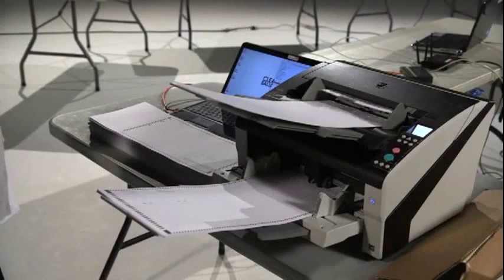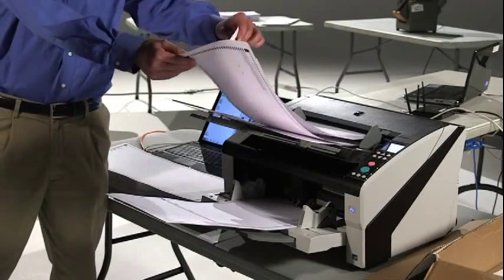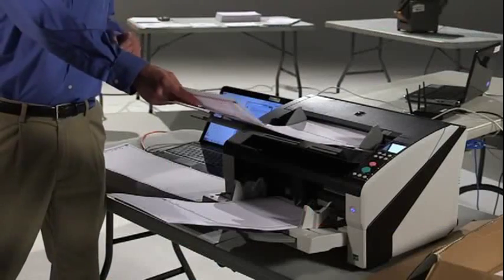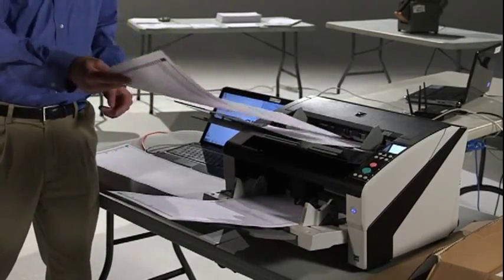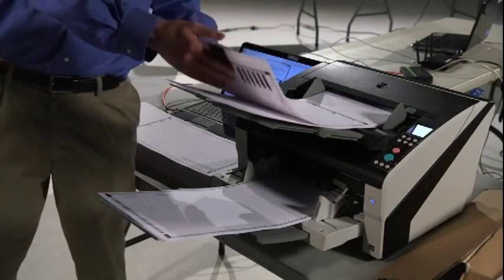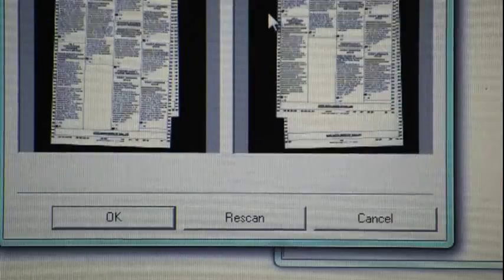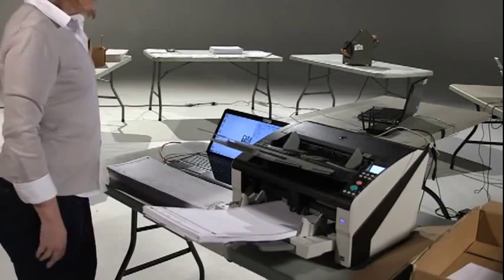On the 6800, when a multi-feed is detected, the scanner will display the two images captured for that scan and will trap the offending pieces of paper before they are fully ejected into the output tray. Examine the images on the screen and the number of sheets of paper captured at the top of the scanner to determine if a multi-feed occurred. If the images show multiple ballots or more than one page is sticking out of the top of the scanner, those pages need to be re-scanned. Gather the pages in question, click Rescan, and reinsert those pages into the input tray.